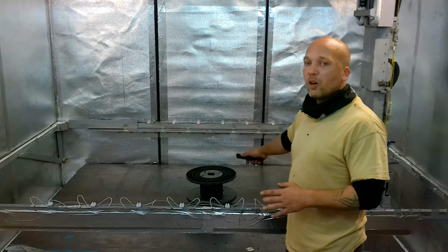I've done some work on the pulleys and idlers because the carriage system wasn't moving smoothly. Someone in a Facebook group pointed out the belt radius was quite tight. I've made some idlers out of HDPE and installed them, and now it moves quite nicely. As you can see - considering the weight of this thing, I'm quite impressed with how freely it moves. It's getting there - we'll be printing soon.